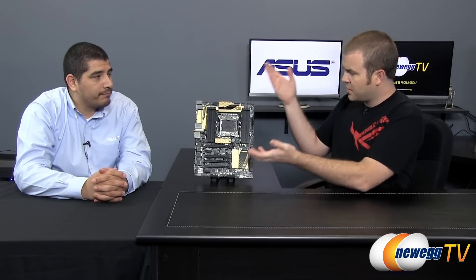You bring up a good point. So just one last thing: ASUS, you guys have done a great job maintaining support for boards after they launch, whether through UEFI updates or software updates. So for older X79 boards, folks at home can be assured they will be 100% fully compatible. ASUS has already released full UEFI updates for their entire range — from a Sabertooth board to a Rampage 4 Formula, Rampage 4 Extreme, or a P9 X79 Pro board. They are all receiving Ivy Bridge E UEFI updates, so you'll be able to patch to have solid functionality, performance, and overclocking. And of course you also have the option of going with something like this one, which has been brought up to speed with additional functionality we've come to know and love over the past year or two.